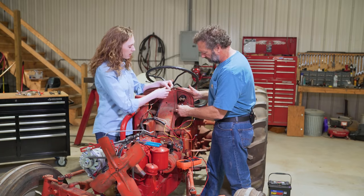Your wiring harness does come with one orange wire designed for headlights. In this video we're not going to show you how to wire up headlights, but if you want to, use that extra wire in the harness, make sure your switch is wired up correctly, and change your bulbs from 6 volt to 12 volt. We also replaced the metal fuel line because it had been chopped off, so we put a new gas line on.